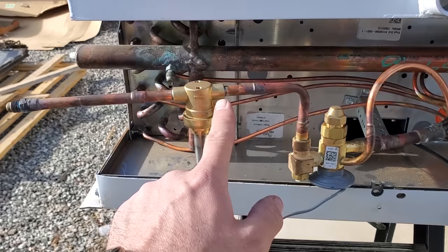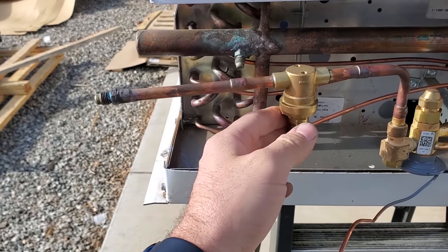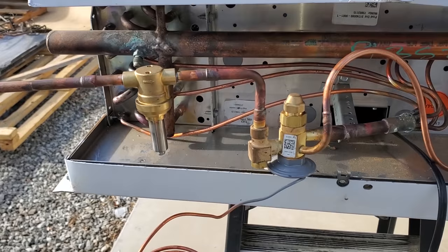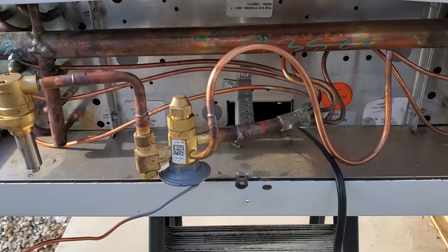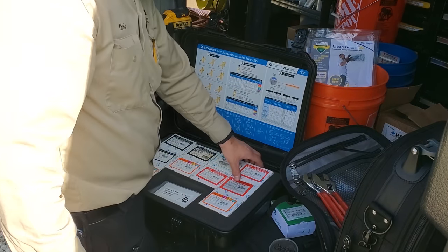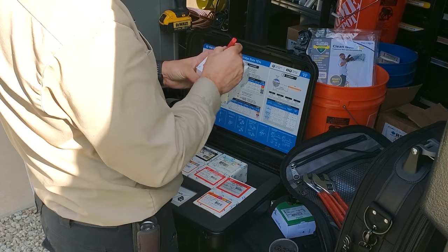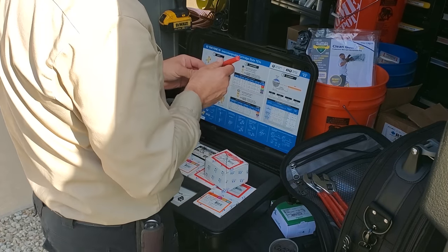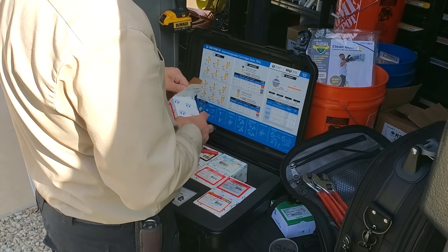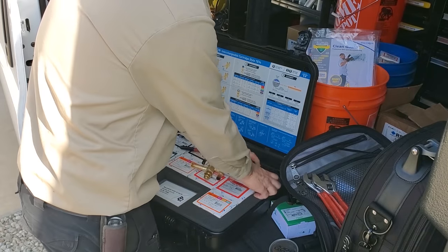So we're going to go ahead and select that real quick. I'm going to utilize their existing solenoid valves. We'll purge with nitrogen, put a solenoid magnet on that if I can fit it on there and get that TXV swapped out real quick. So we're going to go ahead and select this valve — SBQE body. I always put an X on it so I know I need to buy another one. I put it back in there to fill the space. Then according to this, we're going to use a pink cartridge. The cartridges are all labeled on the top — this one's pink right there.